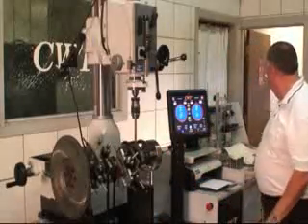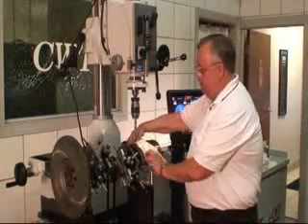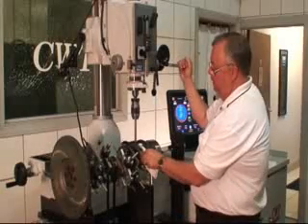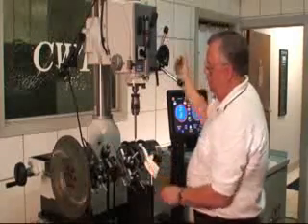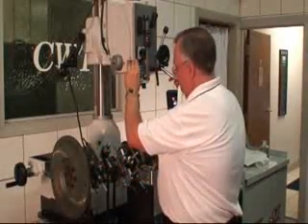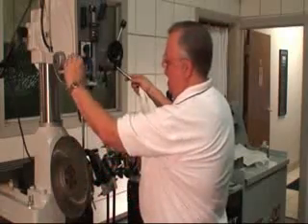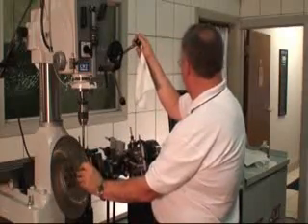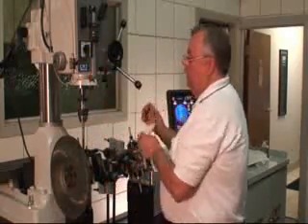Before we drill, we want to try and protect the bearing area. So I'm going to stop and use paper towels or shop towels — we're just trying to protect the greased area. Start up and get a start going. I'm going to turn it off now, move over by releasing the lock, keeping the starter drill in place, over to this position here, lock it, and do basically the same thing. Turn it around to TDC, go ahead and drill, and just get a starter position. Now we're going to drop this drill out and park it.